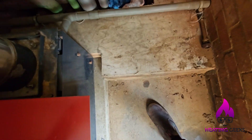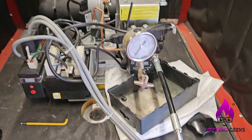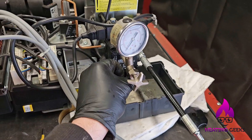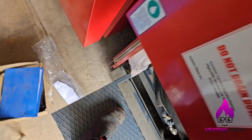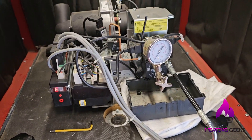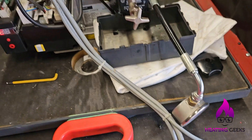Maybe it is that filter which I'll take out if I have to, because I haven't got a replacement. I've got my vacuum gauge and pressure gauge set up. I can bleed it from here. I'm going to reset the boiler — I'm stood on the step so I can get a better view of what's going on and look down the sight glass. I'm most interested in the vacuum reading because I think that's where the problem may lie.